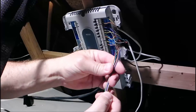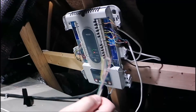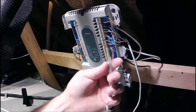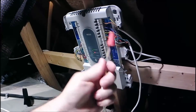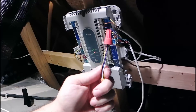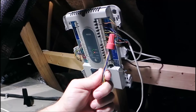We want to make sure they're all going to be able to connect because we're going to put them all in a wire nut. I've got this red wire nut — if it's 10 conductors you put all 10, if it's 8 you put 8. You need at least two to do a continuity check. We're going to put all our conductors in one wire nut and go back to the sub base.